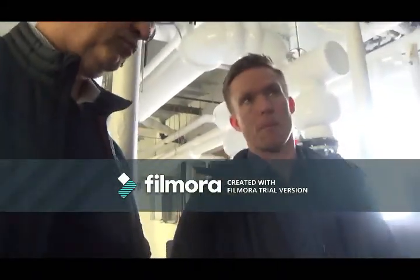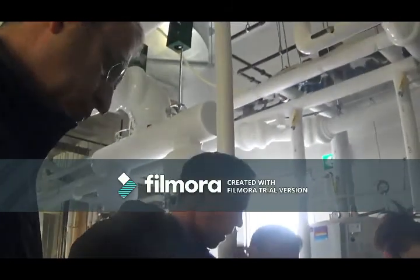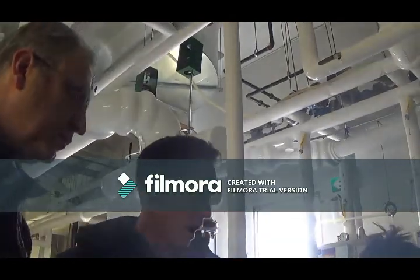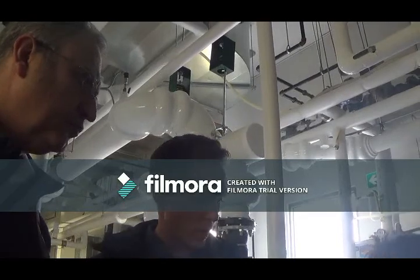It might be worth checking the neutralizers from time to time, but that should be part of the maintenance contract. Because these are non-condensing, but you will see condensate coming from the vent from time to time. So this will have to either run to the drain or have a condensate line. Yeah, so we'll have to hook that up. Right now, I guess they've removed it so they can paint. And they'll probably be pushed back. It looks like it was hooked up right there.